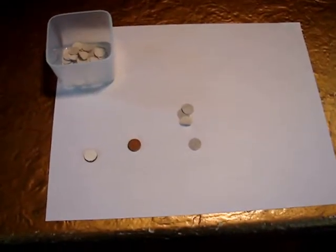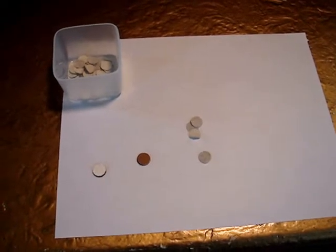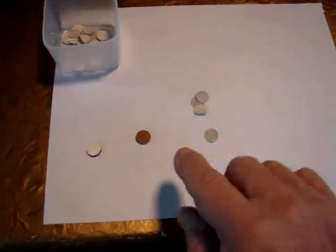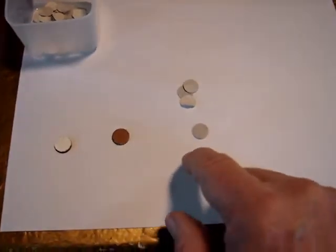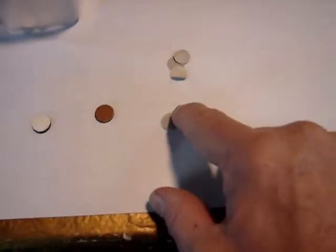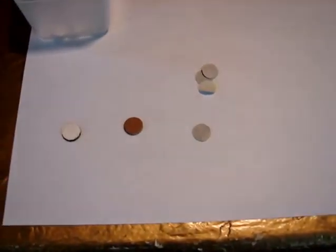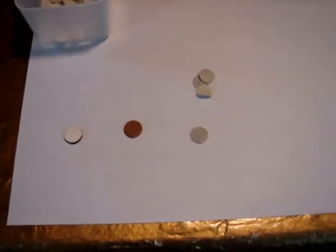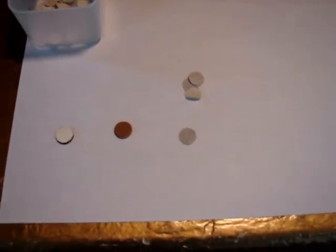Now, another source of problems with the Wangerin Chrysoglott was very noisy armature clicking when you played it. This is one of the armatures, as it is not covered, but we've been gluing these leather punchings onto these armatures to quiet them up when they're turned on. So when the armature is pulled up to the magnet, it doesn't make a loud clicking noise.